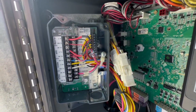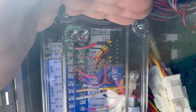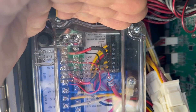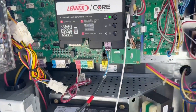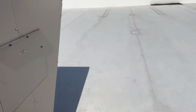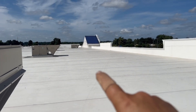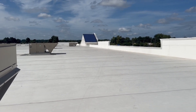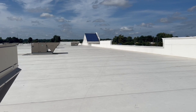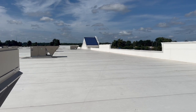It's back green, so I'm going to wait about seven to eight minutes and see what we get. It's been about seven minutes and that trouble has not come back — everything's flashing green, so we're going to call this one good. We'll make sure the fire panel is cleared; if not, we'll have the manager reset it. We just have to come back to this site for that unit — the blower motor that needs to be replaced — and as soon as we get those parts and come back out, I will have a video showing the replacement of that motor.